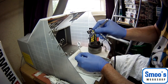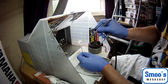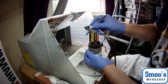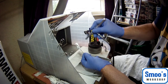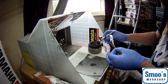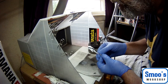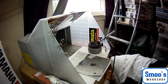And I can see with atomisation there is paint coming out. Gentle, even strokes, at steady pressure, just to get the first coat on there. I don't want to be going too heavy with a thin paint because it will just run. Making sure that each pass I do starts before the workpiece and comes off the workpiece at the end. Just check my compressor is on, that would help. Just having a wee look at this, very fine mist coat, and it looks as if it's caught that wee bit. So I'm not going to go any heavier than that with the first bit. That's just a mist coat, that's just a general once all over coat, very fine mist. So that's that bit done.